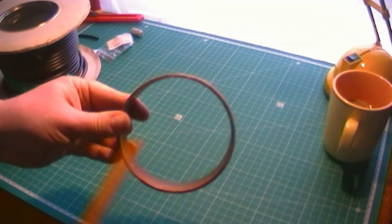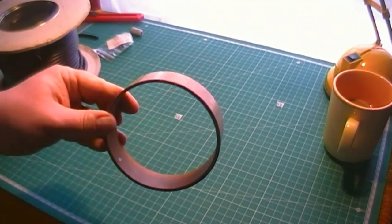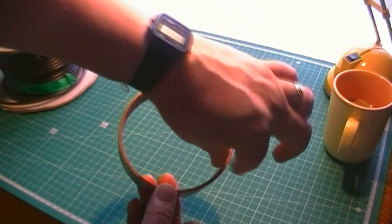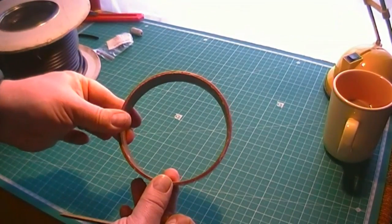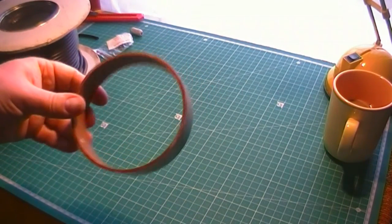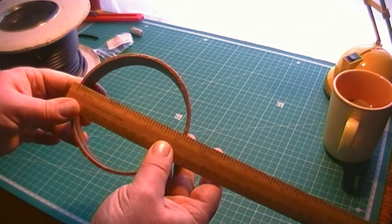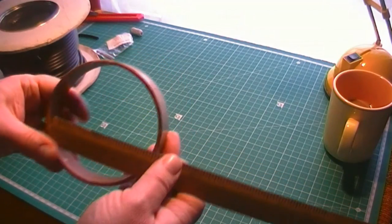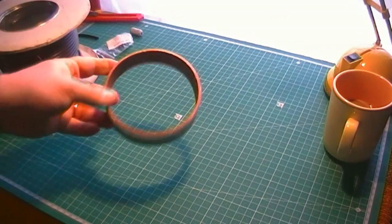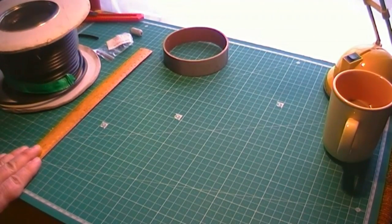Other people have just sort of made a cardboard former, wrap your cable round, and then dispense with the former, and cable tie the actual choke to the right size, no problem. Some people have found a particular Coke bottle is the right size, whatever, but like we say, according to the old chart, 4 1/4 inches is what those readings, that chart's been based upon. So 4 1/4 is what I've always used, and 4 1/4 with the 5 turns has always proved to be a very effective choke for my actual frequency of interest.